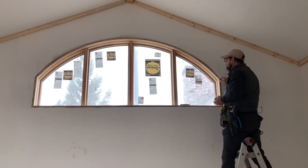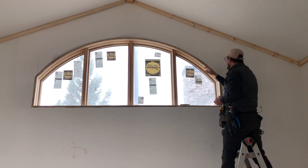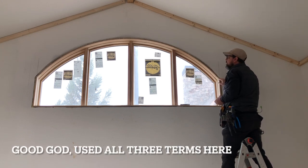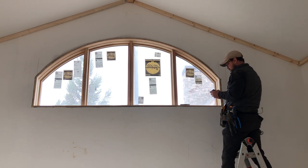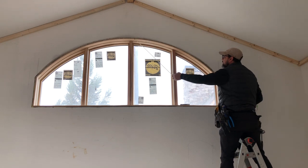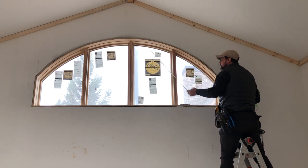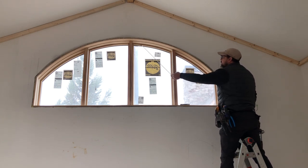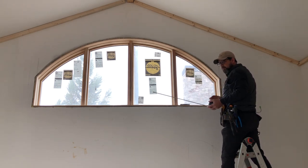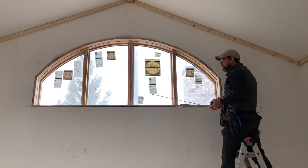We've already pre-measured these windows across the drop of the oval — or the arch, whatever you want to call it — and then we've measured from this point up to what we call the total rise, which would be at the center. We've ordered these by the width of the arch and the rise of the arch, and they pre-bend this molding by heating it.